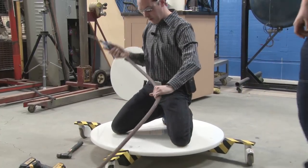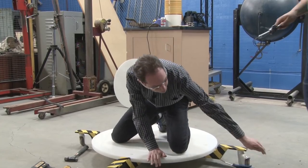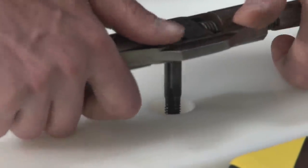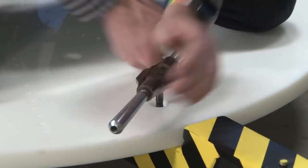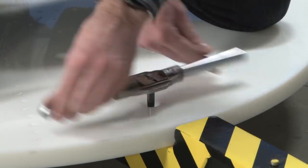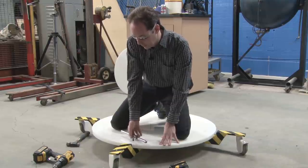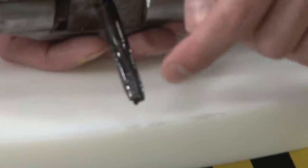Drill out your hole. Now you want to get rid of all the chips — you're going to be tapping it, so you want it clean. Batman's already put some lube on the tap. A tap is another piece of super-hardened steel that is basically a bolt with a lot of material cut away. You take a bolt, cut flutes down its length, and sharpen the leading edge of all the flutes. Give it a good taper — and that's basically what a tap is. You can see here we've got grooves cut alongside threads.